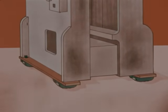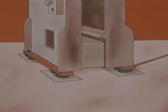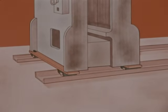If four skids must be used, secure the skids to the load to prevent the loss of any one skid because of an uneven floor. For maximum turning, place four turn-and-lock skids under the load. When the desired point is reached, stop the load, unlock the swivel plate, and turn the skids to the angle required for the turn. All turns of the skids must be made while the load is stationary. In case of rough floors and extra-large weights, the turning of the skids will be made easier by arranging the move so that the skids will be stopped on a piece of thin-gauge metal. The problem of roller skids digging into soft concrete can be solved by laying steel channel on the floor to serve as a track.